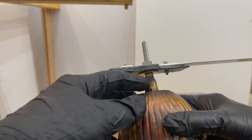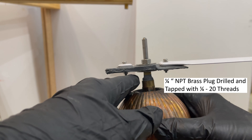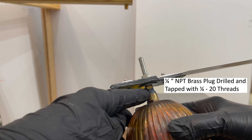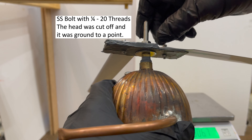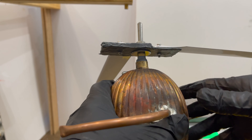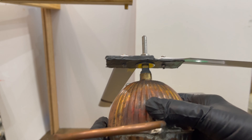In the original Aeolipile from my last video, I had a pop-off valve here. I took that out because this doesn't seem to build up that much pressure, but I still stay away from it because it could be dangerous. I replaced it with a quarter-inch brass MPT plug. I took that plug and drilled a hole in it for one-quarter-twenty threads and had an extra stainless bolt laying around. I just cut off the head of it and tapered it to give it a smooth surface to turn in the holder that I made.